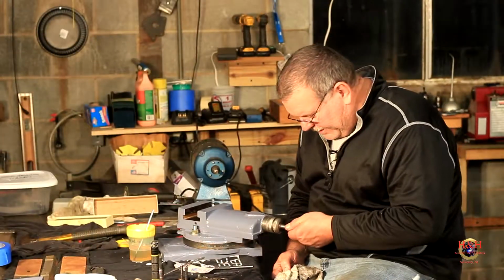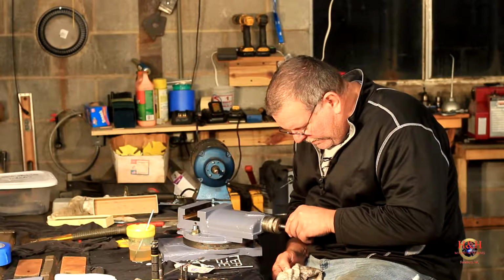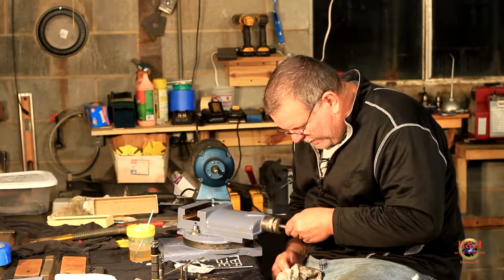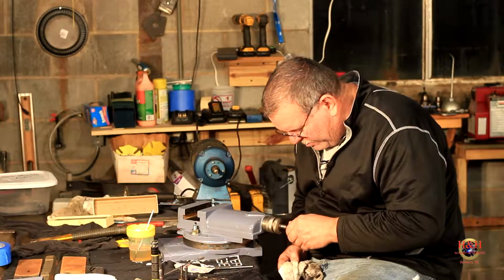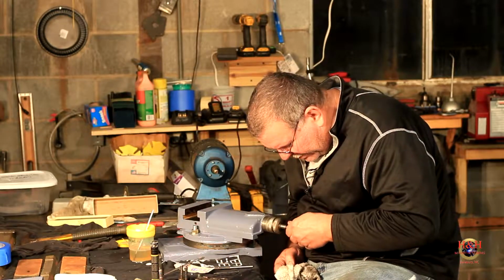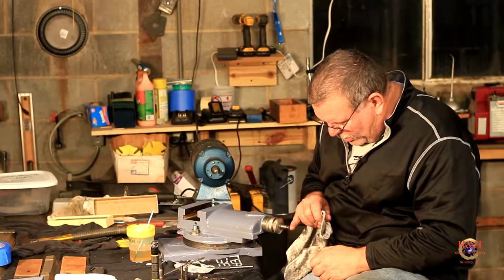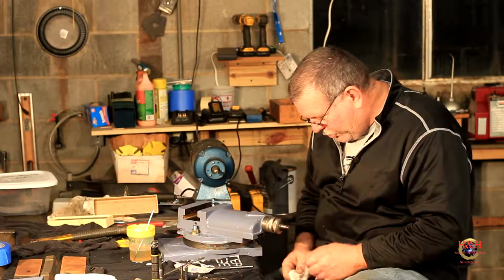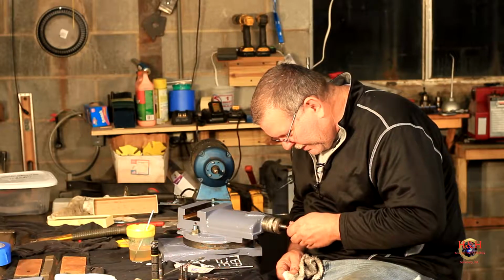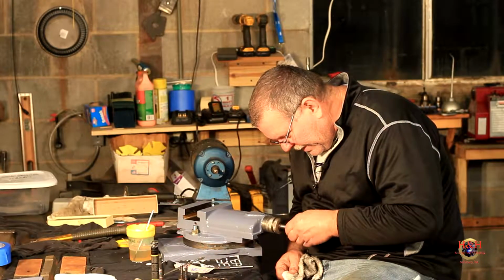All right, I think that'll do it. Wait on my brother to get the handle. And then that's the last thing. I don't have to run a tap in the acorn nut, buy another acorn nut, or check the threads on this other end. If you've ever watched A-Bomb's videos, you know he always tells you to chamfer that edge before you thread it. Now you know why. Because, man, getting that first thread started on something that hasn't been chamfered is a booger. Not going to lie.